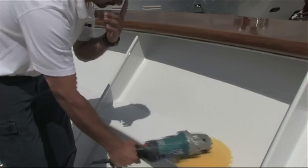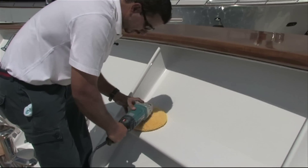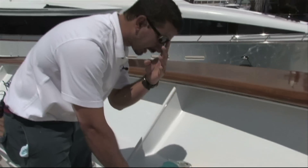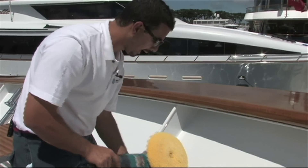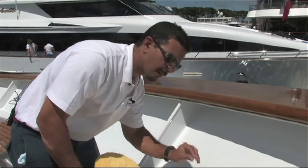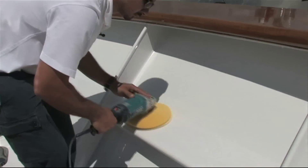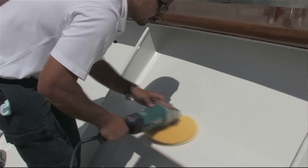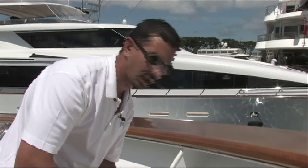At this point all the surface has been covered, and I can see it's slick on it. So I'm going to speed up to about three and a half, which is about 1,500 RPMs. As you can see, I can go back and forth over the surface and break down the polish even more — I let the pad do the work. The pad is not creating any heat; the surface is not hot at all. It's just creating the proper amount of friction because the surface is so lubricated that the pad just slides through it. Contrary to a lot of products that haze out and burn through the paint because the pad creates too much heat — the lubricant is what actually does the work. Lubrication is so important in buffing.